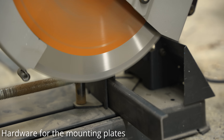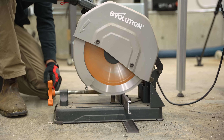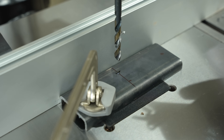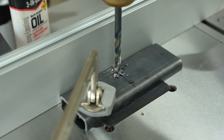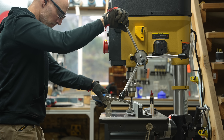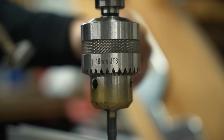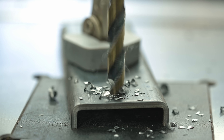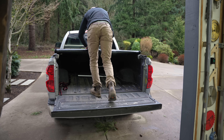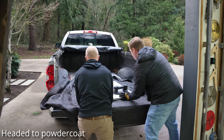When I started building these two tables, I thought they'd be essentially the same with a few small differences. As it turns out, they were wildly different. For one, the finish on the mappa table was much different — I actually tried spray finishing for the first time, and it went pretty well. The mounting system is another difference: I made small custom C-channels for the heavy table, while on the smaller table I was able to use figure-eight fasteners. The large table top weighs over 200 pounds, the base itself weighs about 200 pounds — it's literally a 400-pound table — so the mounting system has to hold up.